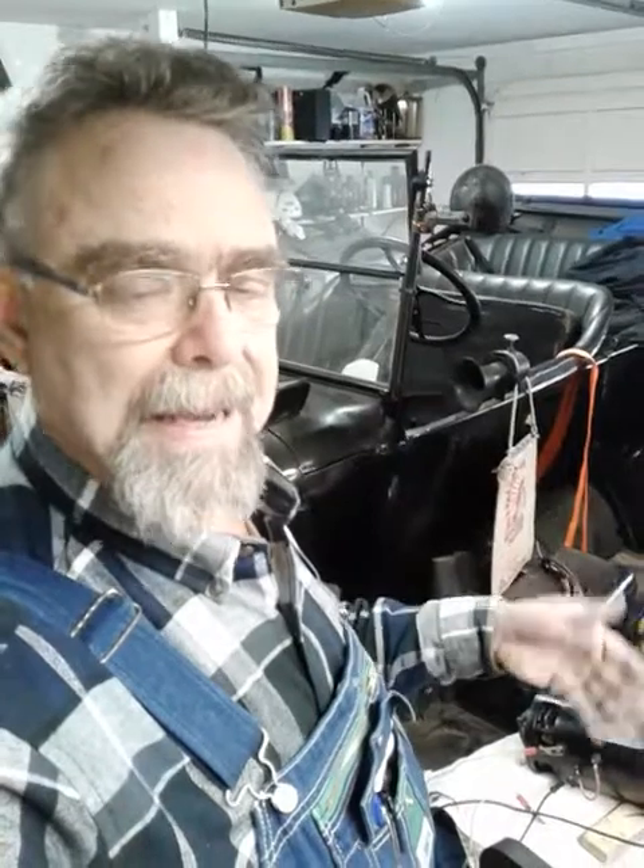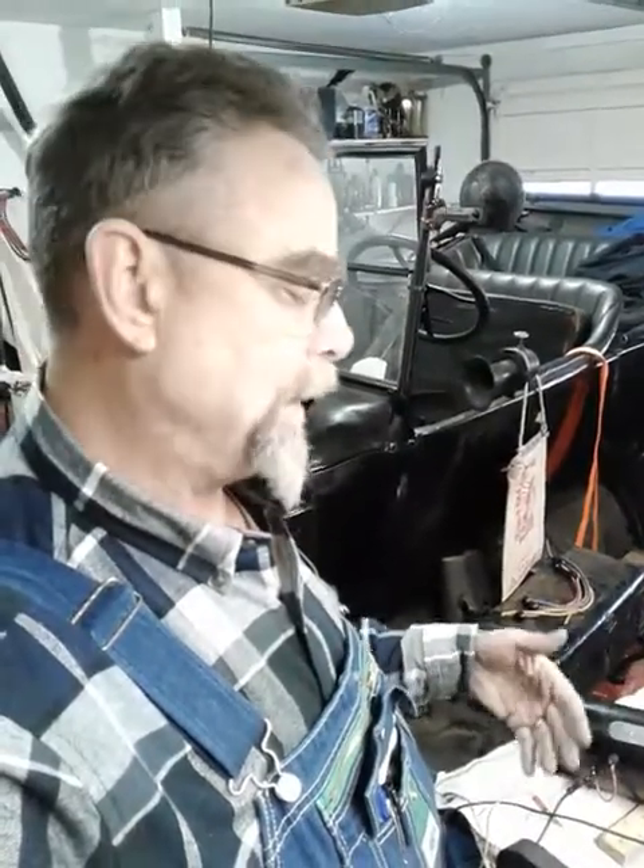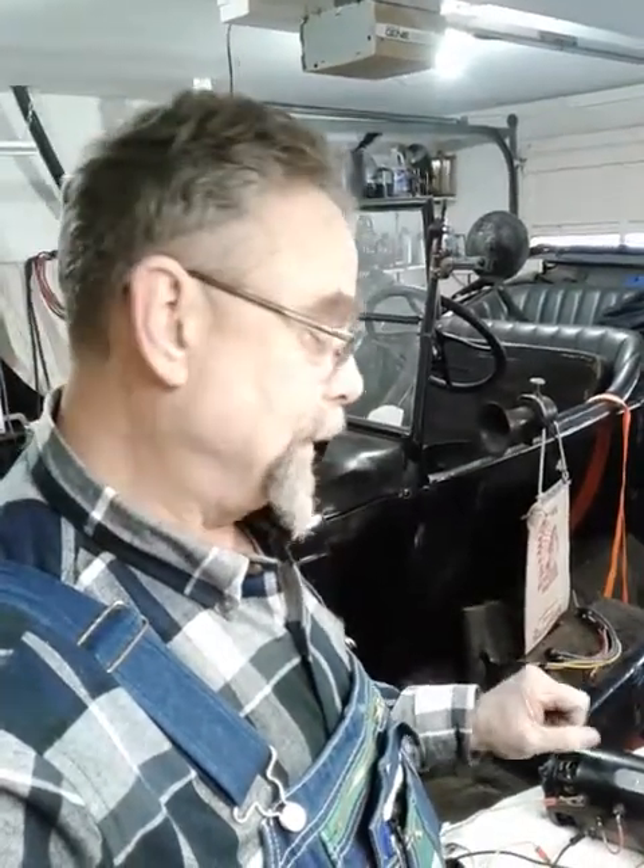I realize not a lot of people are going to want to rebuild their own generator — they're not really confident doing that. But hopefully this will give you an idea of what to look for if you want to buy a rebuilt generator. Ask the questions. Now you have a better understanding of what's going on inside them and what it takes to rebuild one. Ask those questions of a vendor selling a rebuilt one — what was rebuilt, what was actually done? Rebuilt can mean a lot of things, but it's not just a set of bearings, some new brushes, and a slap job of paint. Now you understand about the field coils, how you service the armature, the wiring — all the little things that go along with doing a quality rebuild.